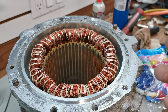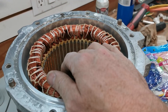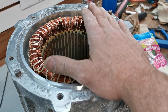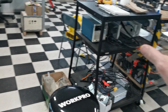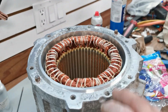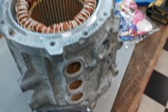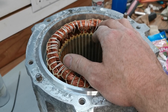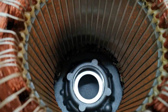On a road course doing three or four laps, every straightaway heats up the windings, but when you lift off the throttle — even during regen, which probably isn't as strong as acceleration — and in corners where you're applying light throttle, the motor is doing some cooling. The goal is to raise continuous and peak power. Peak power wasn't really the bottleneck anyway — the controller and battery pack were. Running dual controllers to two separate sets of windings is easier than designing a bigger single controller, though we do have a higher power controller coming.